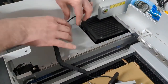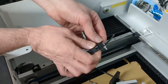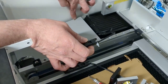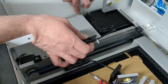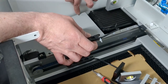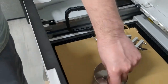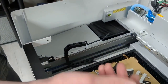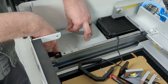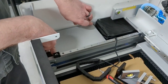This cord is tied on one side of this drag chain, but we have a hole on the other side of the drag chain. I'm going to run a cable tie through this hole to hold it down in place by this screw. You have two options: you can drill another hole and put the cable tie through that, or you can put it through this existing hole and simply omit that screw. This isn't a structural piece so it should be fine — I'll go ahead and secure it there and reinstall this plate with only the two back screws. If you want to be more diligent, re-secure the plate with all three screws and give yourself a new hole.